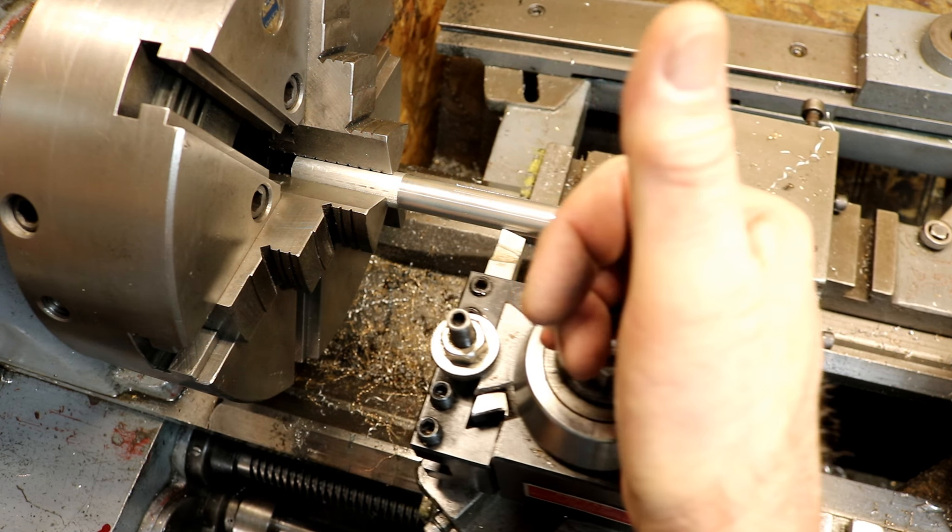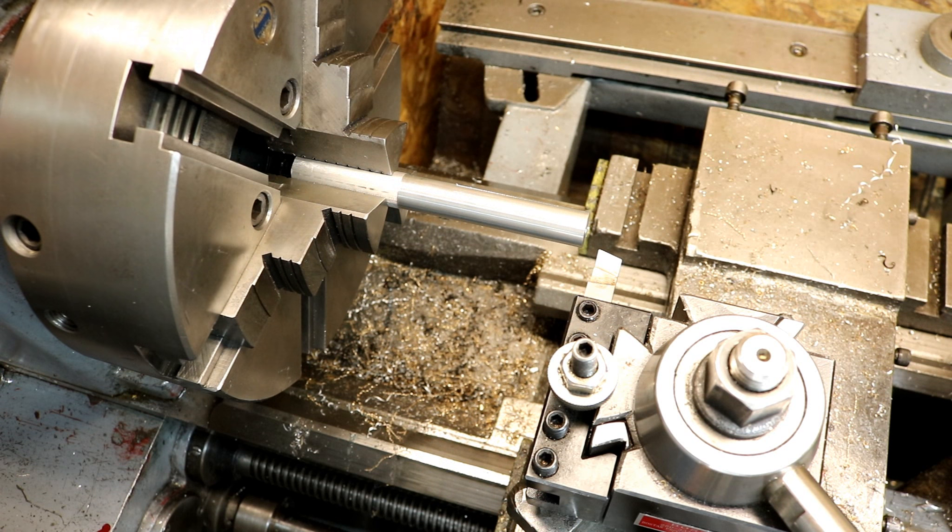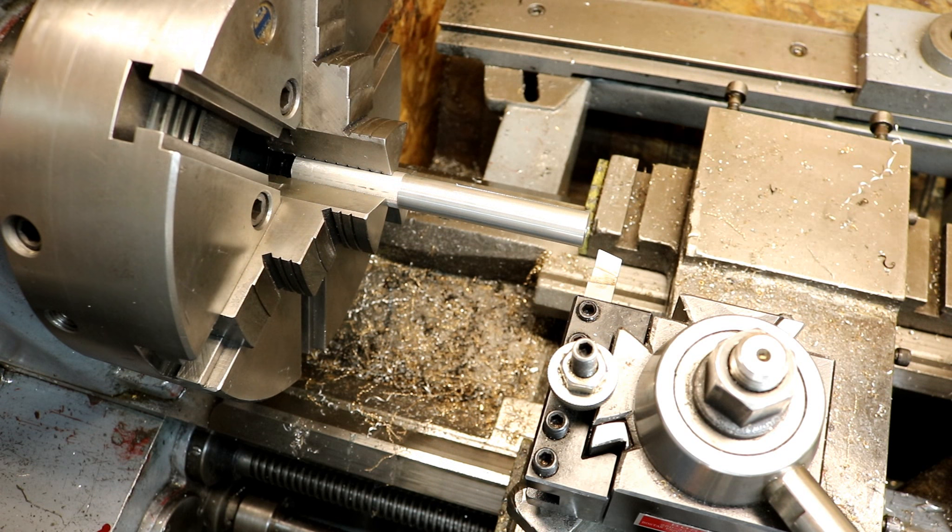Now if you're boring, you don't want to leave a line or a score mark in your bore either. Depending on the side and how you're boring, you need to just push or pull your tool post to move your tool off your work and you won't leave a mark. Thanks for watching metal lathe hack number two — please subscribe and we'll have some more coming.